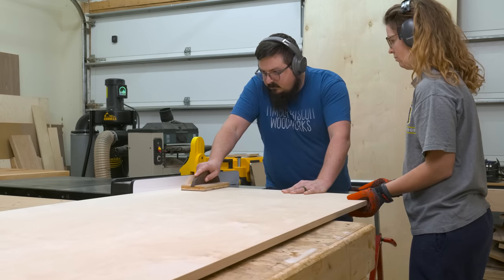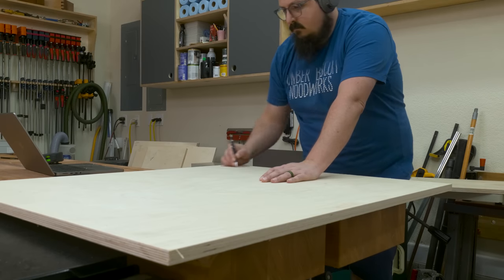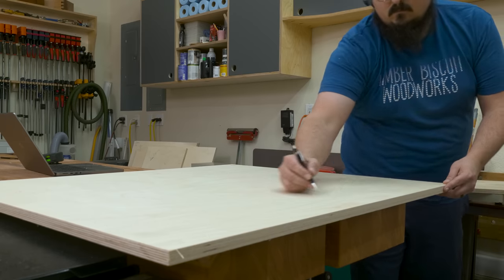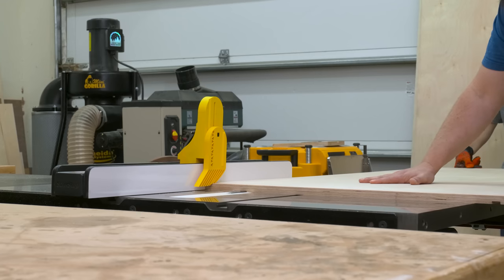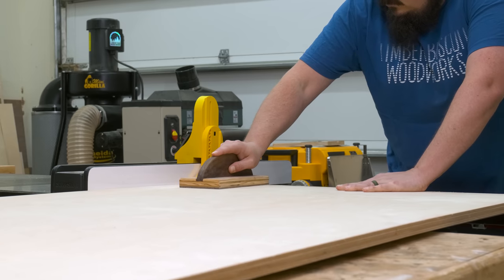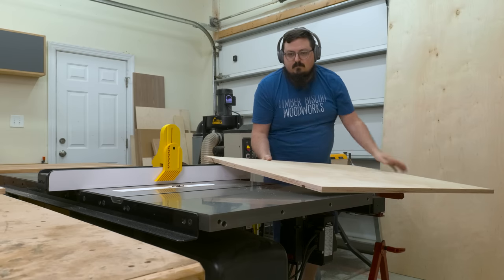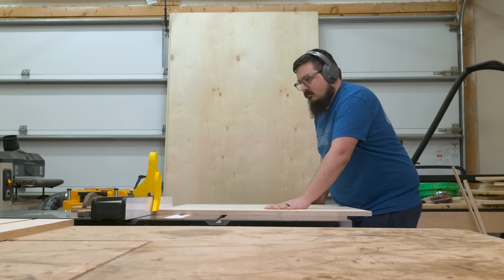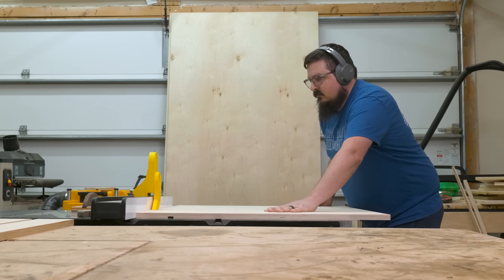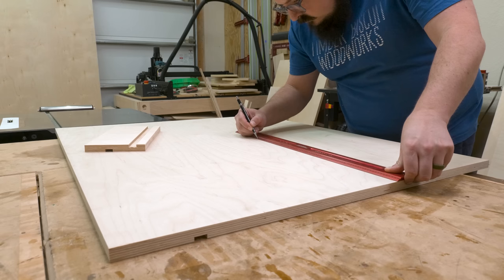Because of the panel sizes, I asked my wife to come in and help with a couple of the pieces just to make sure that they stayed flush against the fence. Then I could mark out on my boards where those rabbets and dados should live so that I don't go back and mess them up later, and then get back to cutting my dados. The lower portion of this cabinet is going to sit three inches off the ground, while the upper portion is going to give me four inches for a small shelf. This is cool because it will allow me to clamp pieces directly to the top of the assembly table, and it'll give me somewhere to store clamps when I'm in the midst of a glue-up frenzy, as we know all great woodworkers have.